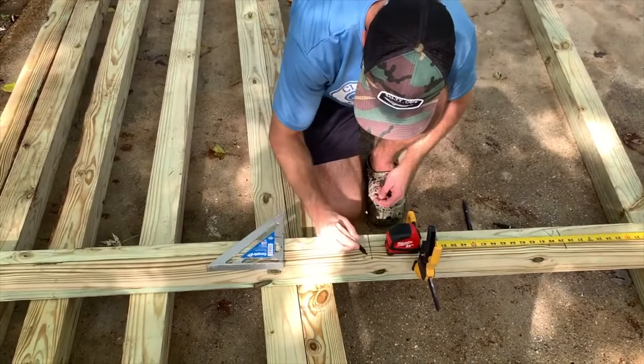I'll also link one of my blogs in the description, which goes over the shed window framing process step by step. At this point, we're going to go ahead and mark our 4 feet to frame in our windows. This 4 feet marking is for the cripple studs at the bottom of the window that are going to support the sill plate. I'm cutting 2 for the first sidewall, and then I'll cut another 2 4-foot cripple studs for the second sidewall.